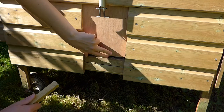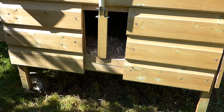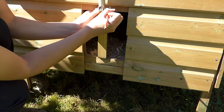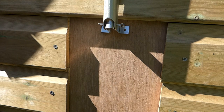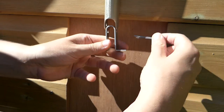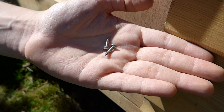Next, an off-cut of timber 8.5 inches or 22cm long will help to keep the door open whilst you mark the position of the door footing. The split pin can then be removed and the door footing secured to the marked positions with the 12mm screws provided.